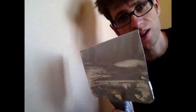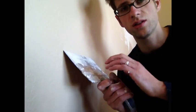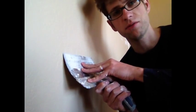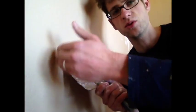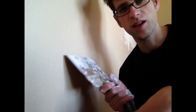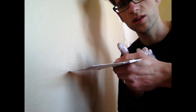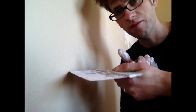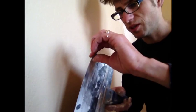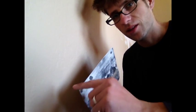It's also very helpful to have a good trowel blade. This is a stainless steel 8-inch blade and it has a real consistent flex. The blade when it flexes — see that real smooth curve — cheaper ones will just bend from the back and don't have as good handling. Also, you can see when I point it this way, the blade is bent upwards at the corners, and that makes it not gouge my finish. I actually bent this myself — a lot of times they come like that a little bit, but I bent this one more.